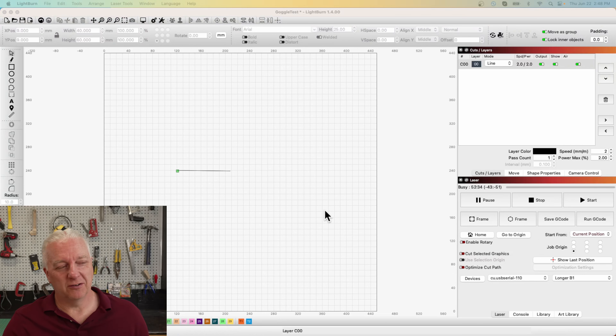Here's the quickest experiment you can ever do. I drew a single line, set the speed to a very low value of about two millimeters per minute so the laser is really not moving at all, and then set the power to a super low value — I can't stress this enough, because if you have it at a higher value you'll cook a hole in your glasses, especially if they work really well. In my case I set it to two percent. Really the only thing that's important is to see enough light through the goggles to know they're having some impact.